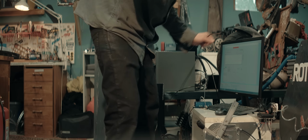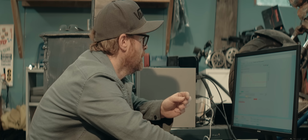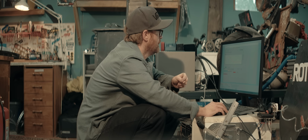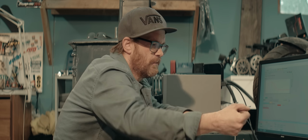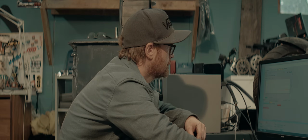I'm gonna try adding in even more timing at low RPM. We're at 30 degrees up to 8000 now. Let's bump that up to 35. I think we can add in even more. 40 degrees at 6000, back down to 35 at 8. Between 6 and 7000 seems to be the place where the blower is starting to make enough flow for the reed valve not to be needed. Let's see how it behaves now.